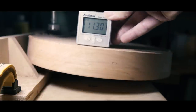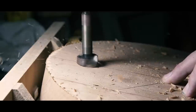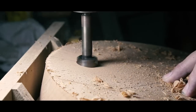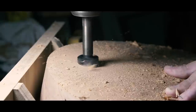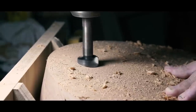Traditionally, this would have been done with a hand brace and bit using sight lines and bevel gauges, then using a reamer to taper the mortise. I wouldn't be tapering my mortises because I don't have a reamer, but I do have a drill press, and instead of messing with tilting the table, I find stacking scrap against a fence an easy solution for drilling at an angle. My mortises will be at about 5 degrees, giving my legs stability.